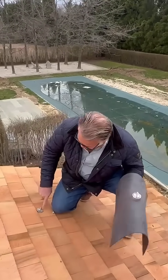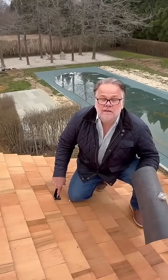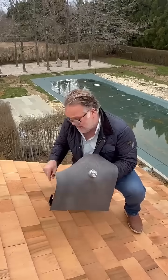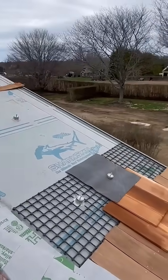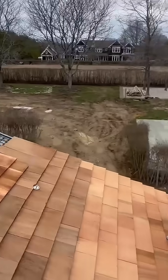And this is an example of the finished product. Attach your L-foot and you're ready to attach your solar. You're sealed at the top of the flashing, sealed at the bottom of the flashing, and you're also sealed at the membrane below. You can see up here how it goes into the membrane — sealed, sealed to the underside of the flashing, sealed to the top — and then you install.